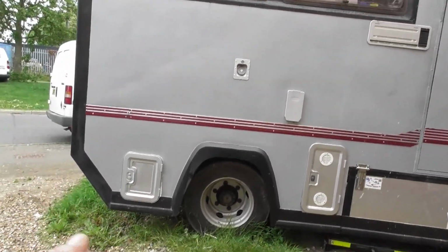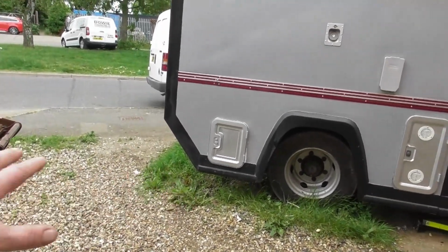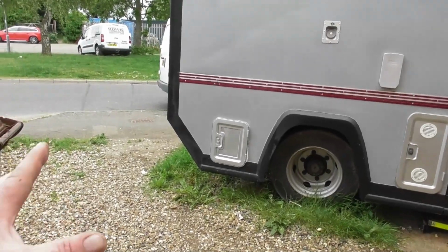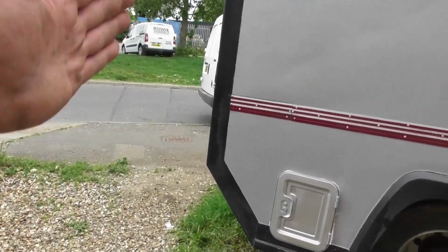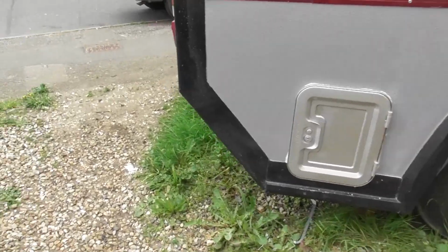Obviously, having air brakes, they're going to have to wind the screw out on the duplexes and release them, but if I've got too much of an overhang, there's the risk it will hit the ground. Second reason is when you get put on the back of a low loader, that back end has a habit of hitting the ground. That's why I sloped it. It was just me being practical. If I had my way, it would have gone straight down, because that would have given me another area for another locker for another day.